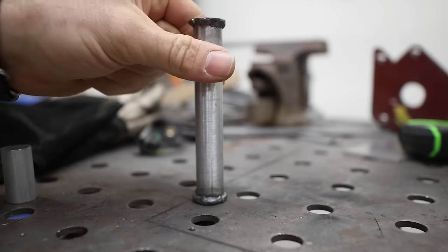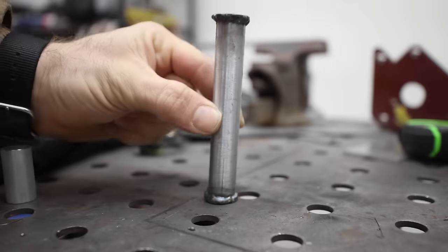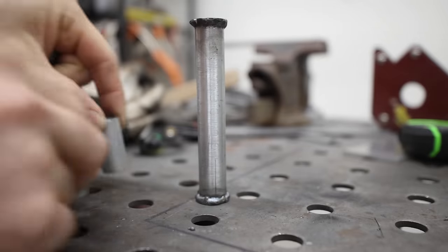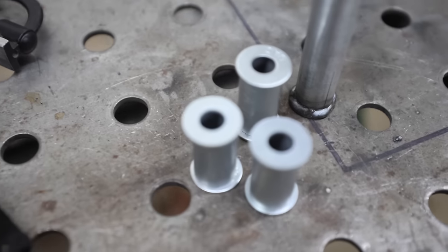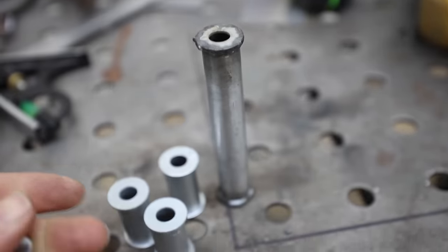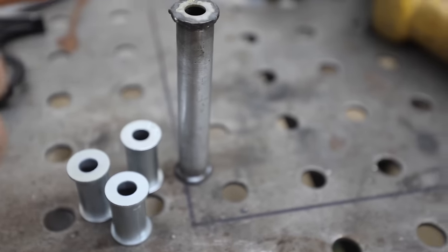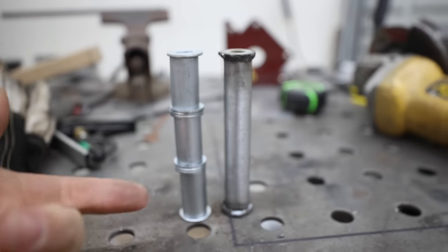For the third and fourth arm, we're actually going to be making three miniature versions using three short sections of conduit with a bunch of washers stacked on top of each other, spaced by washers. Once welded up, it'll equal the same height as the regular hinge piece. Let's get all this welded up.